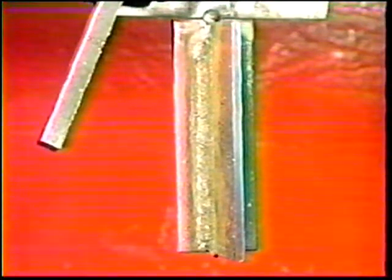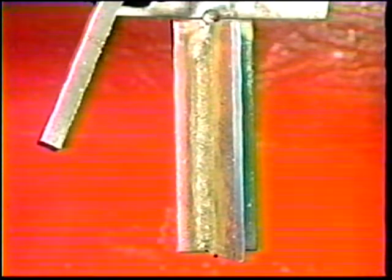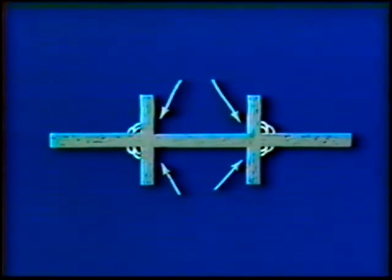When the third bead is complete, clean off all the slag, cool the workpiece in water, and inspect the weld. Then complete the multi-pass weld on the opposite side of the joint. For additional practice, tack weld the 5-plate assembly as described in topic number 8 and weld the remaining joints. Inspect the welds and then check with your instructor.